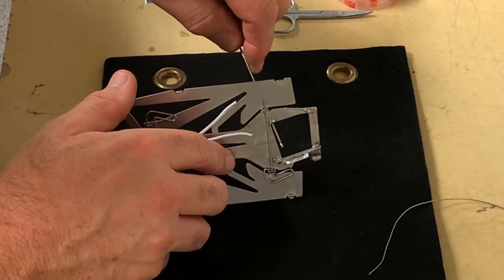Now that we've got the wires pre-tinned, we're going to go ahead and attach them to the back of the ESC where the brushless motor attaches. Now, I know it looks intimidating that there's three wires, but it really doesn't matter. If you put them on and the motor doesn't spin the right direction, you just reverse two of the wires. Just put a touch of solder like that.